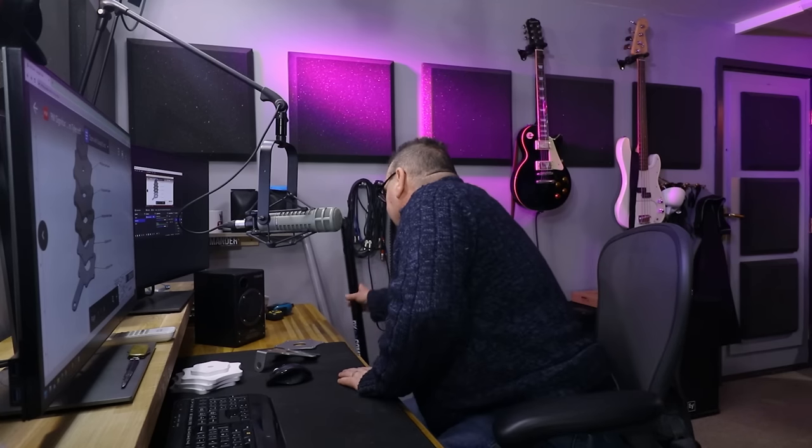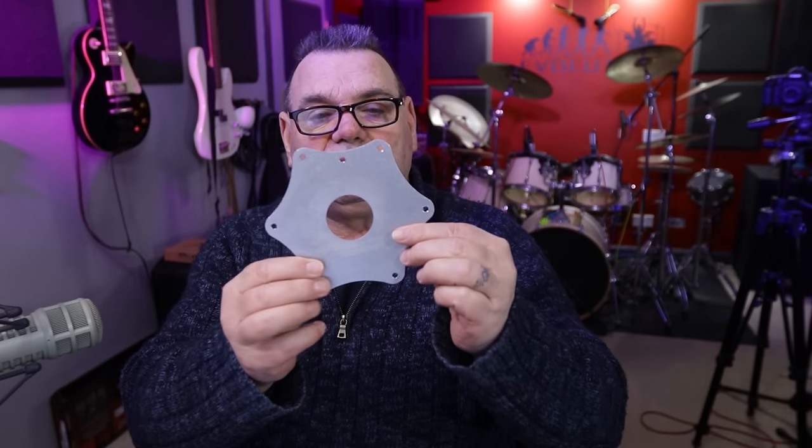Just a reminder: there's a lot less bend on this than on the classic. We've got a driven plate as well, so the SO239 — all your elements come up here. You'll want to know: can you do 80 meters on this? You could, but it'd be a shame — I've really designed this for the guy who wants every band from 40 to 6 meters. You'll get a perfect tune that way, including 30. If you want 80 meters, make a linear-loaded 80-meter dipole and stick it at fence height. You can put an inverted-L on this if you want — it's exactly the same.